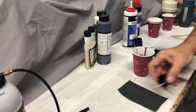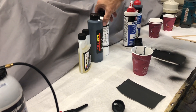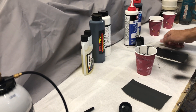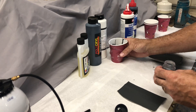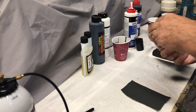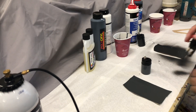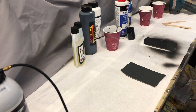PolyKryl is a little bit thinner of a material than SurCoat, and that's intentional so that it'll soak into the surface and adhere very well. SurCoat is a polyurethane and it's thicker, so it acts more like a coating than it does a penetrator.